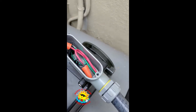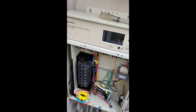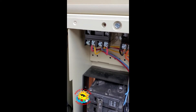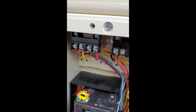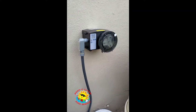Let's put the lid top back on this. And then we'll hook up the pump relay. Pump relay number one — one and three are the line side, that's the power continuous. Two and four are the load side of the switch. So that's all hooked up and ready to turn this on and see where we're at.